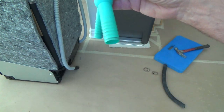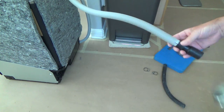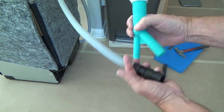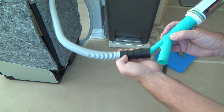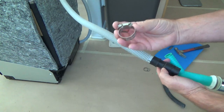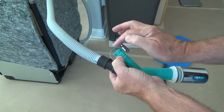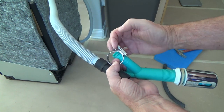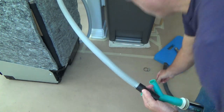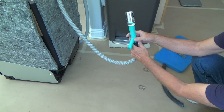Here's the air gap. It normally gets installed on the counter. This is a small fitting and here's a bigger pipe. The dishwasher drain hooks up to the small pipe on the air gap — the large end is too big, so you would cut that first part off. Then you'd use a smaller hose clamp. Sometimes a slightly smaller clamp is easier because as you tighten it, the end has a tendency to wrap around. You can cut off excess length with tin snips.